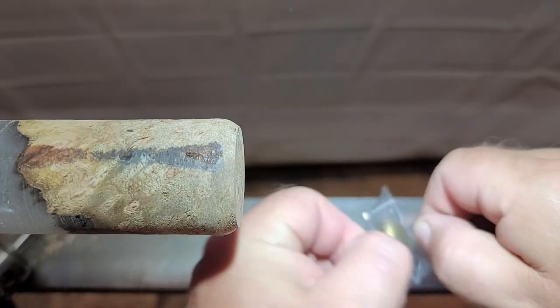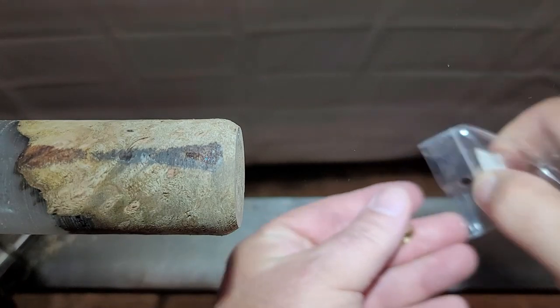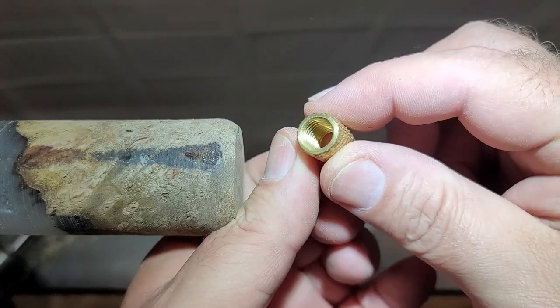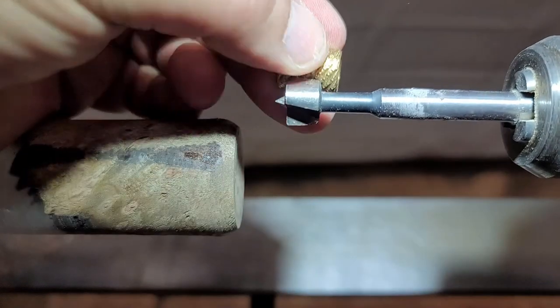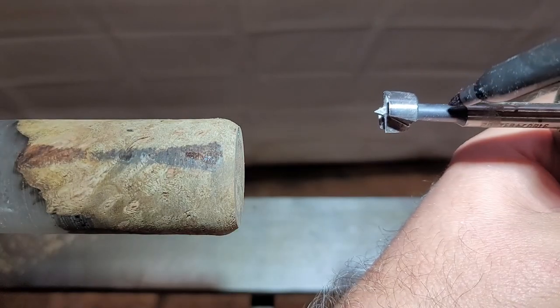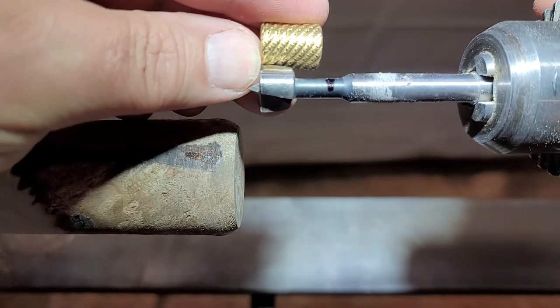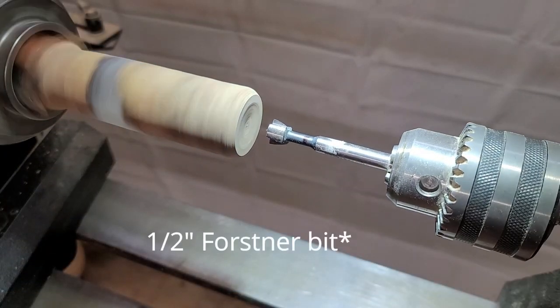I use these knurled inserts — I get them from Stainless Steel Bottle Stoppers, the same company that produces the bottle opener itself. You could go the other way and drill it out and tap it for the right threads; I've done that and it works. But I find the wood has a tendency to wear away and it's not as secure. In production mode these are relatively inexpensive and efficient. I drill just slightly deeper than the insert itself so it's recessed — that's a quarter-inch Forstner bit.